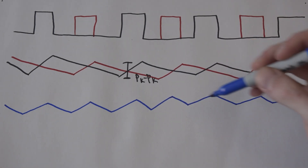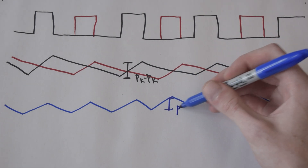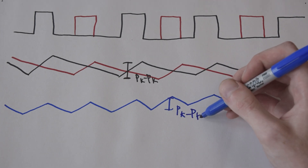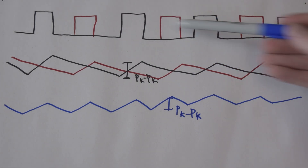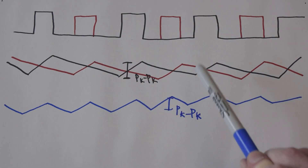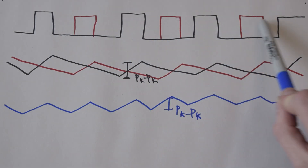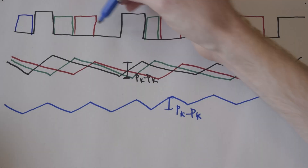Although drawn very poorly, hopefully you can see that the combined peak-to-peak is about half of the single-phase peak-to-peak, meaning we've reduced our ripple — which is critical for applications like CPU power delivery. An interesting side effect is that we've also doubled our effective ripple frequency. So say we're switching at 100 kilohertz with a period of 10 microseconds, because we've also got the pulses from the second phase, the distance between any two pulses is actually 5 microseconds, meaning the ripple frequency is actually 200 kilohertz, despite no single MOSFET having to switch any faster than 100 kilohertz. This higher effective switching frequency is another major advantage of a multi-phase buck converter, as it greatly improves responsiveness to transients and changes in voltage demand. And of course, the more phases we add, the better our voltage ripple is going to become.